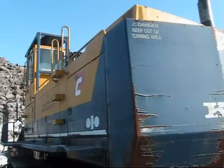Around back here you can see your counterweight on the 1000. You'll notice that the crawler pads are really narrow — shovel fronts this size always have really narrow crawler pads. If this PC-1000 were a mass excavator it would have much wider pads. The reason you want narrow pads for a shovel front configuration is because the machine is meant to work in rocky or solid conditions, so you don't really need wide pads. If the pads are wider and the machine is turning and crawling around on rocks, the rocks are just going to bend the pads. You can also see the superstructure and where your counterweight is bolted on to the back.